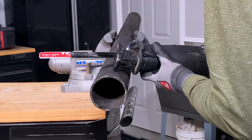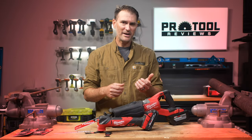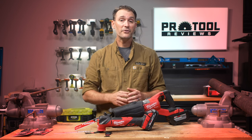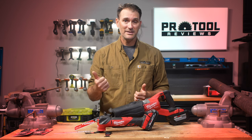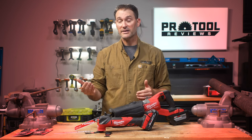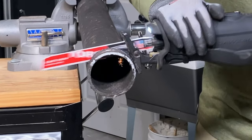There was a little bit of damage on the front cutting teeth, but the back teeth were in good shape. When we rocked the saw, we could tell that it was melting better through the back end than the front end, but the whole thing was still cutting well. So what would we consider the lifespan in this particular pipe? For gen one, we'd say it's one cut. For gen two, we definitely got through two good cuts. Even if you look at it with damaged teeth — one and a half cuts versus three cuts — we got twice the life out of that second generation blade compared to the first generation.